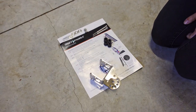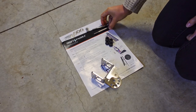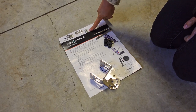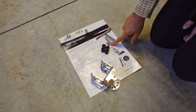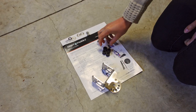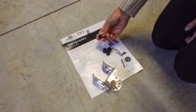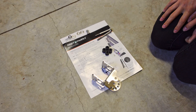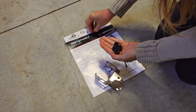So for this installation, these are the items I grabbed out of the hardware kit: the two quarter-inch bolts, four flat washers, two nylock nuts, the stirrup mount, and four plastic spacers. Now the kit comes with two sizes of spacers. Since I'm installing the paddle onto the power pole blade, I'm using the longer spacers. The shorter spacers are used for all other power pole models.